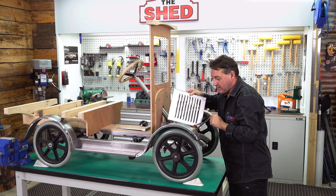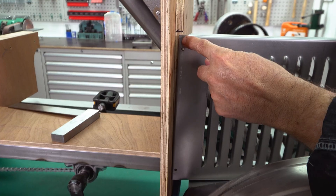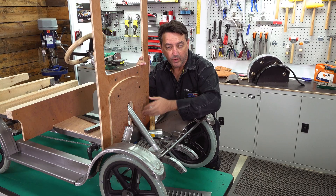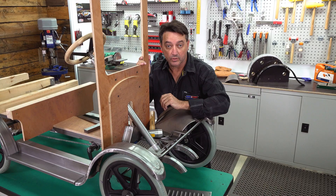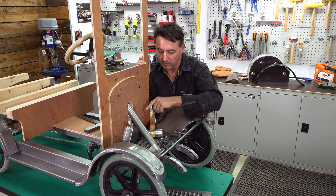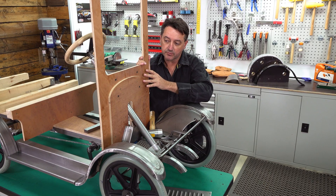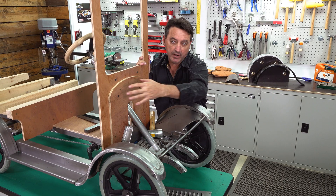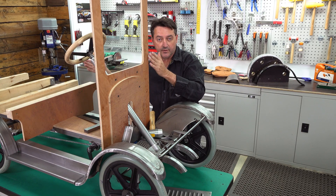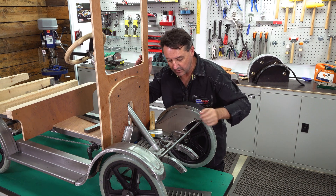This horizontal face has to be dead flat. If there's any misalignment or it's out of square, that will affect every other piece that will be attaching to the firewall. If your firewall is out of alignment or out of square, refer back to your mounting point on the steering column - we may need to shim or pack. There are a couple of things this will affect: number one, our front end panels and bonnet; number two, the doors, the fit and alignment as to how well they close.